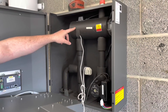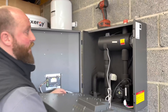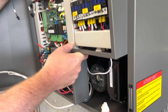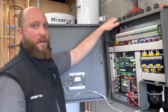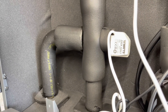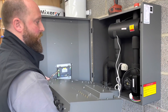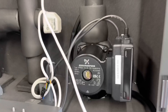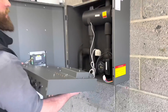That's the three kilowatt backup heater, and that's where the pressure gauge and PRV will link on. It can either be used to do the legionella cycle once a week, as an emergency backup, or to supplement the power from the heat pump. The diverter is just a normal three-way valve with an actuator on it — something to keep your eye on for maintenance, but it's all covered under a 10-year warranty. And then we've got a big 25/85 pump as well — plenty of flow rate.